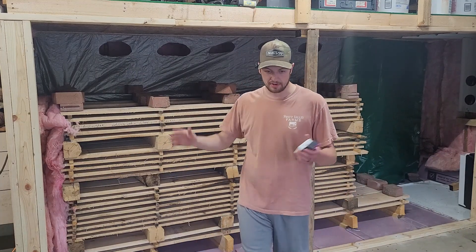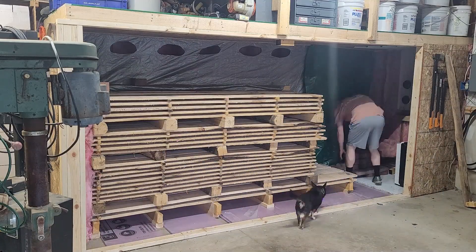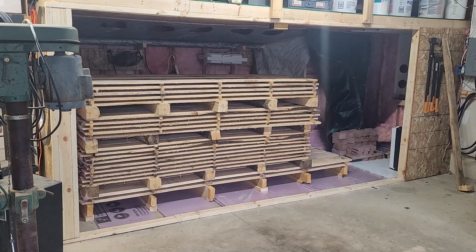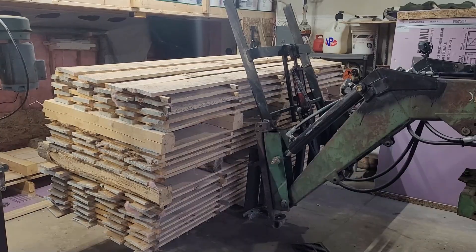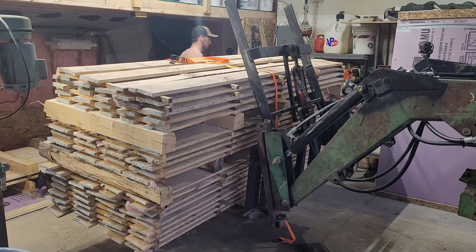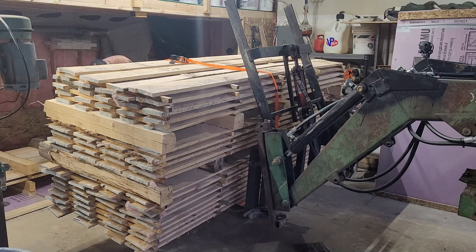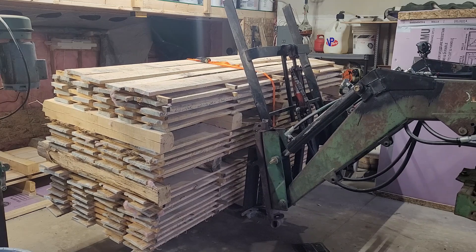Let's get this pulled out, and I have another batch of lumber going in. A few more details on time and temperature: I'm able to get the kiln up to about 130 degrees if I run the dehumidifier continuously, but then it gets too dry. I think working up to about 120 degrees for the first week and then holding 120 degrees at 30% relative humidity for another two-ish weeks will get four-quarter boards down to about 6.5% to 8.5% moisture content. Thank you for watching. Subscribe if you want to see more of my projects and hit that notification bell. Leave any questions in the comments and I'll be sure to answer.